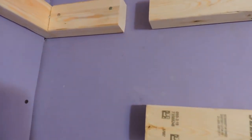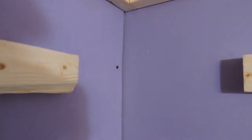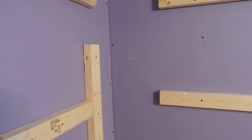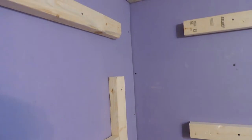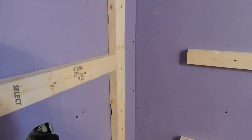I believe when I get to that part of construction you fasten the pieces together first before putting them up to the wall, then they fit in. These pieces form the skeleton for the tub surround. It's not heavy-duty — it's very light-duty plastic — so in order to hold the stresses and pressures and keep the thin plastic from breaking, the wood structure is what holds it in place. That's why it was designed this way. A one-piece fiberglass unit would be self-supporting, but this one isn't.